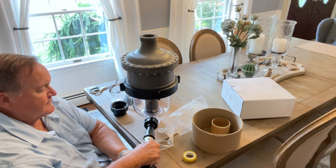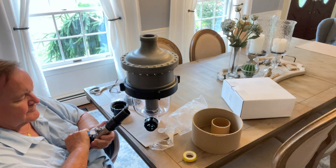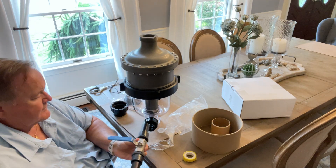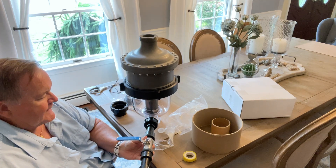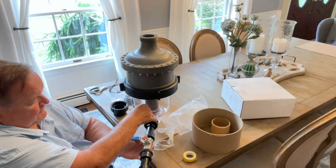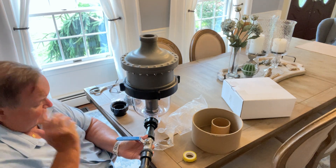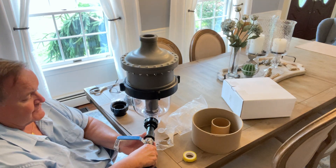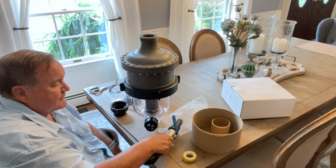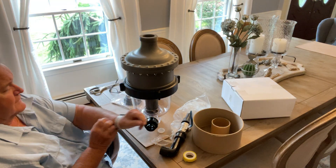When the pump is running, the ball valve will typically be closed. When you need to clean it, you crack that valve open — dirty water will flush through here, come out, and waste it. You just shut it off and resume running. That's about it.